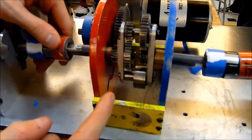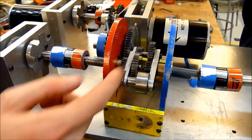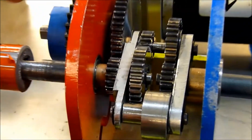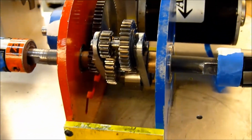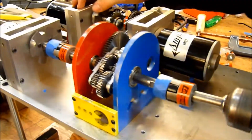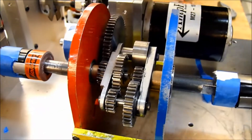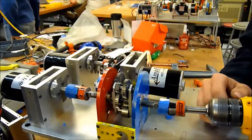As you can see, we have two sun gears and two planet gears rotating around them. Nick had a really good idea to put a counterweight on this side since we couldn't afford two more gears — to balance out the torque as it turns quite quickly. The planet and sun arrangement outputs not exactly a one-to-one ratio, so we have a reducer here with a three-to-ten ratio, which brings the overall ratio down to exactly half the inputs.